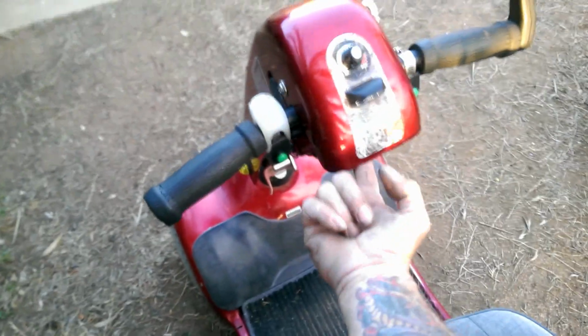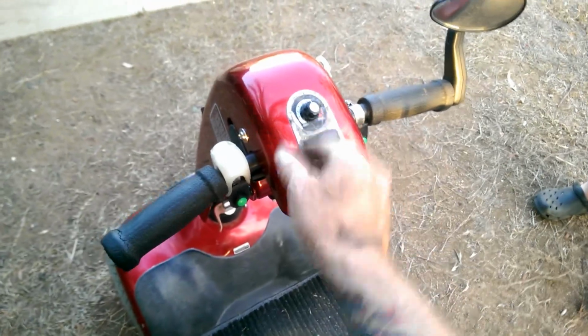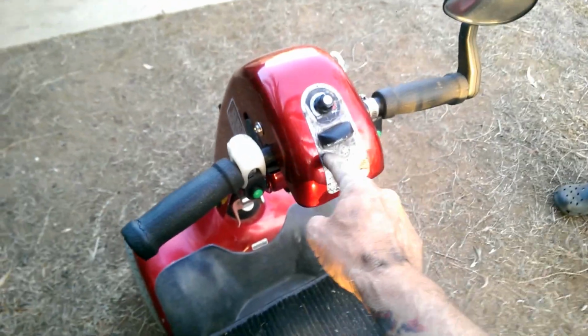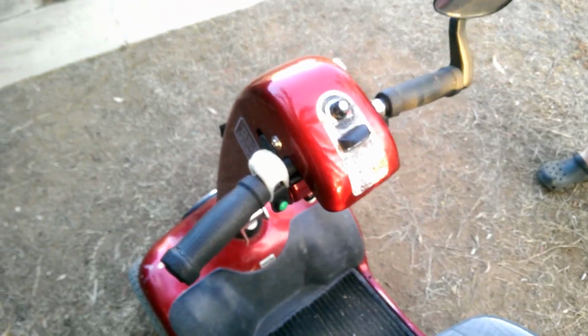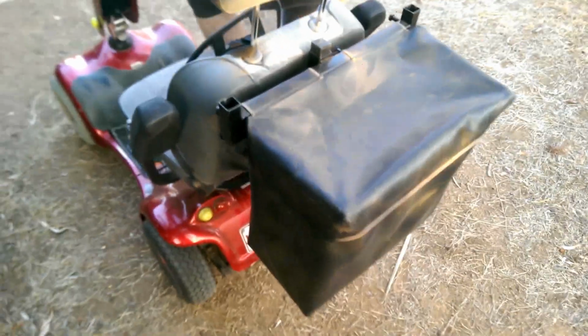No way. She works. You're kidding. No, I'm not. What was wrong with it? For some reason, the wires still wanted to be connected to the potentiometer. So all I did was solder the original wires and the new wires onto that. It works. So yeah, jump on, try it out. I don't believe this. I've turned the throttle down too, so it's about halfway.